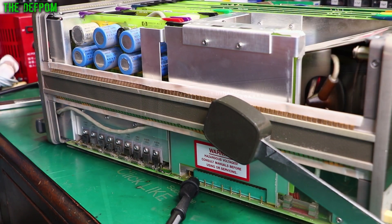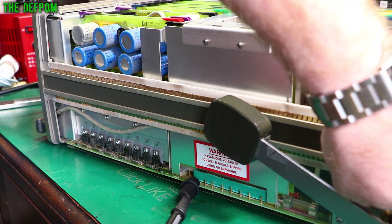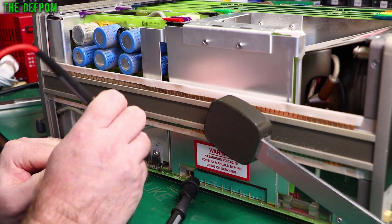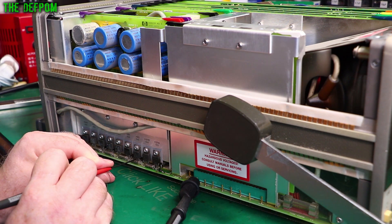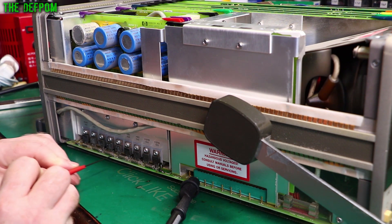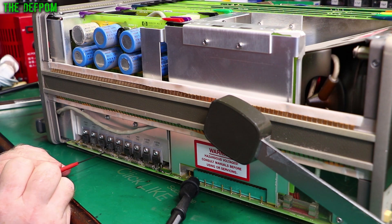So I think we do have a RAM problem. That's inconvenient. I'm going to test voltages on this just for sake of completeness. It does look like it's got a RAM problem, but let's test voltages before we go away. That is doing 11.8 volts - slightly low. It's also 11.8 volts. Minus 12, it is. This should be plus 8 - that's 7.96, that's fine. Plus 5. Maybe that's a separate rail - I'm not getting anything there.